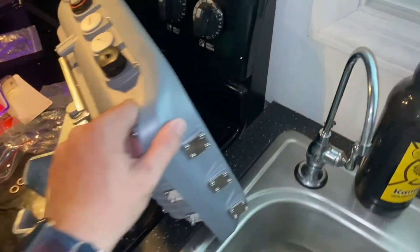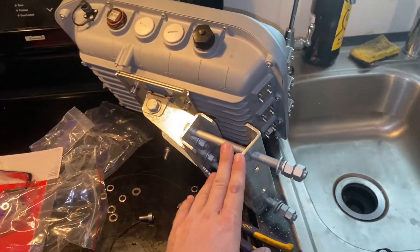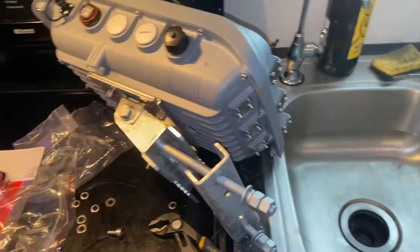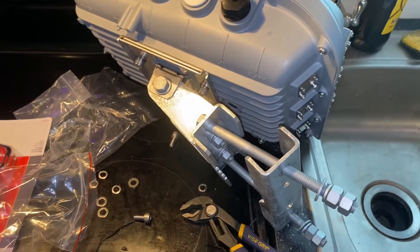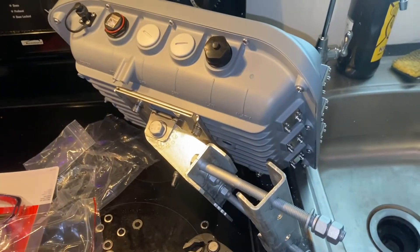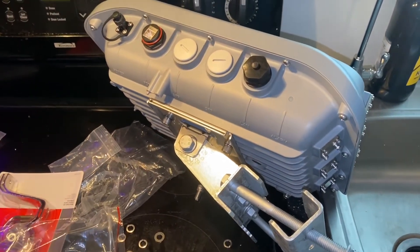For the small cell, I have an outdoor one. These were not cheap — kind of on the expensive side. I think this kit alone with just the FreedomFi — forgive the fact I'm doing this in my kitchen — it recommends you start up and do it indoors before you actually register it. The PoE hooks in there, comes with a gland. It's really designed for a round cable but it does seal up well enough with my flat cable. Comes with a pole mount but does not come with any other mount. I'm going to use a small satellite television J-hook — you can get it at any home improvement store for about 20 bucks — and I'm going to get it at least 15 feet off the ground and level. That's really important.